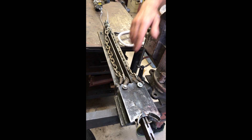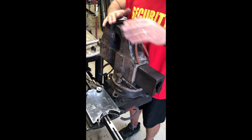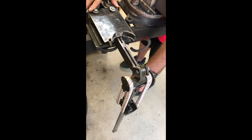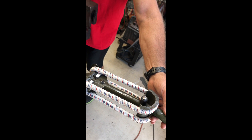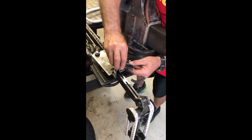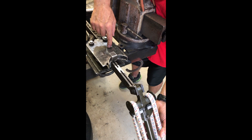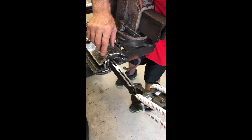I've got it bolted down to my welding table — unfortunately my vise is also welded down so it's in the way. Ordinarily this would be a lot easier without coming over the top of the vise. In theory: we get the bungee in position on the one loop on the collar of the gear leg, bring the gear leg up stretching the bungee, with the draw plate in tight enough so the bungee can still be stretched. The clip sits underneath the plate and over the top of the bungee cord.